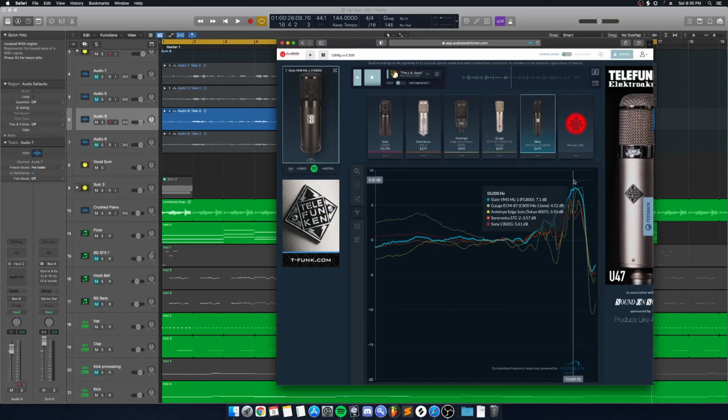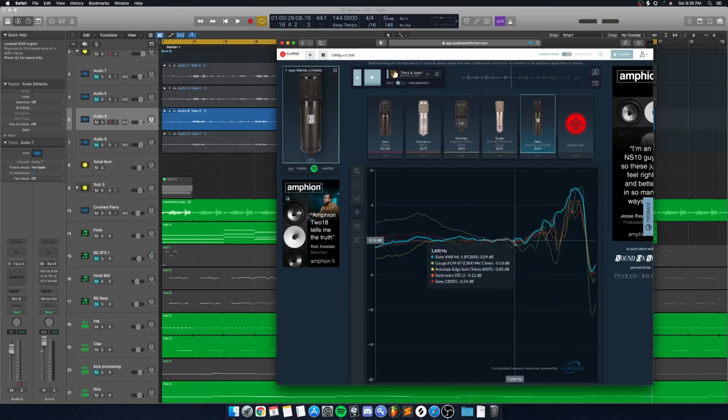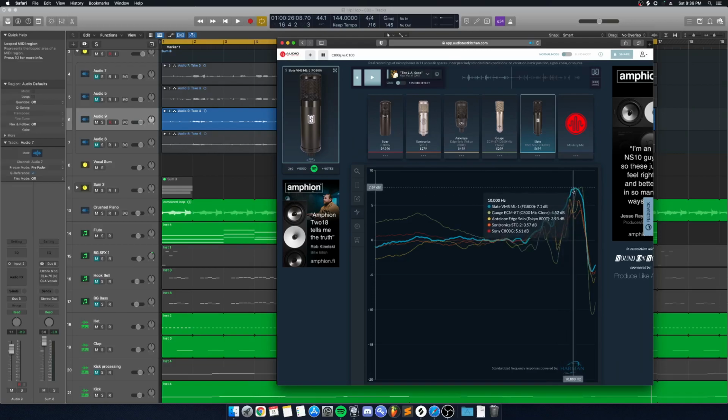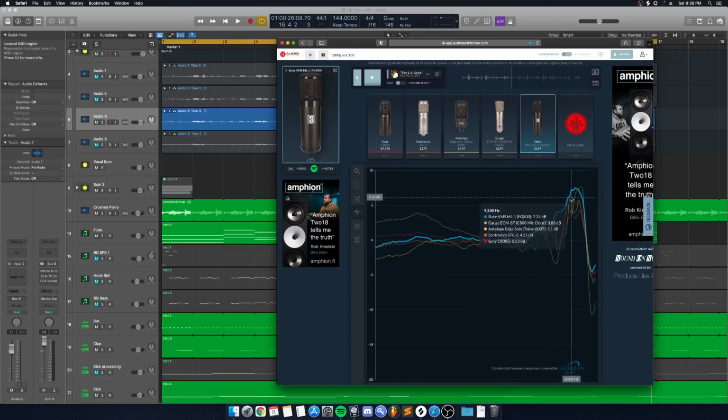Yeah, it just kind of sounds sibilant. That's a perfect word for it. It sounds very sharp, not particularly pleasing, and you really do notice that the presence kind of immediately drags into the high frequency content that's just sharp. Because we're not having that nice little slight boost and then a boost in the high frequency air. We're kind of just seeing this gradual increase, which makes the mic sound kind of shrill because we don't have a distinction between the air and the presence.